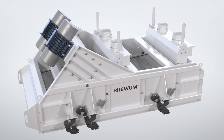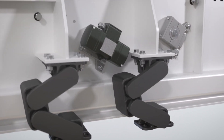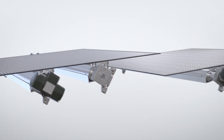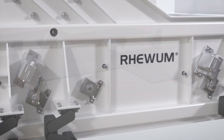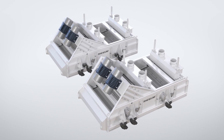In the RE-VATO, additional unbalanced motors provide for very high degrees of separation and further dewatering due to the direct excitation of the screen cloth. The RE-HYDRA overcomes the cohesive forces by an even higher acceleration of the extremely powerful magnetic vibrators and thus achieves highly efficient screening results.